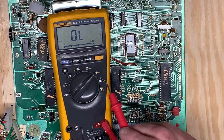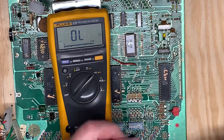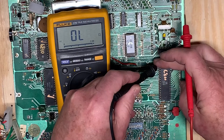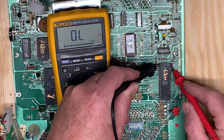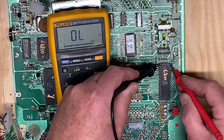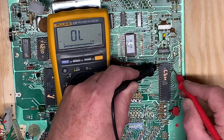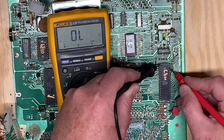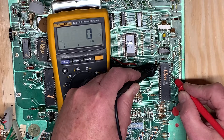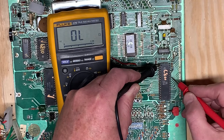The first thing you do is set up your meter to continuity, then place your probe on pin one of the processor, and then just rake the rest of the pins. Anywhere you get continuity, like here, you know there's a short between those two pins. This one in particular is on purpose because pins 1, 40, 39, 38, 36, and 35 are all connected to ground.